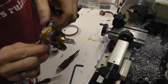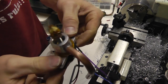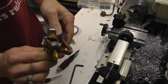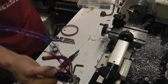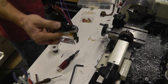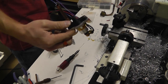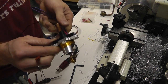There it is - this is my new hot end. It weighs less than the old one - just that big brass piece by itself is as heavy as the whole hot end. I didn't know any better; I got aluminum this time. I've got air ducting going in and just blowing air around that screw and across the heating element and onto the actual print. Then I've got my new heating element and the new hot end tip. I'm going to be putting these on this pipe, but right now the JB weld is setting up. I got these new RC connectors - those big round ones are my new connections because my cheap old fan connector melted. It's got a new liner - a piece of PTFE Bowden tube. Tomorrow I'm going to install this.